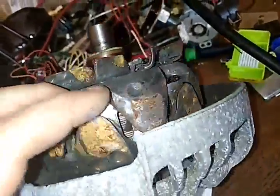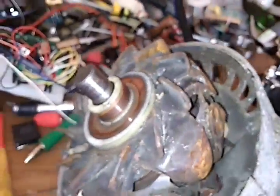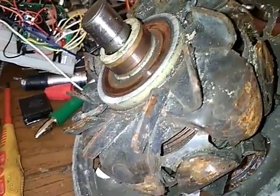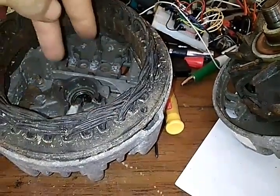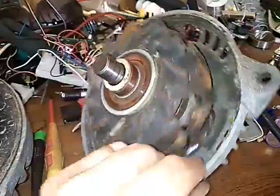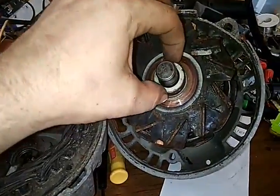But yeah, the coolest part about this is the fact that this is wound exactly like a synchronous motor. So, in all actuality, if I magnetized these coils by shorting the circuit and put alternate current to this, it would turn at a very high speed as well.